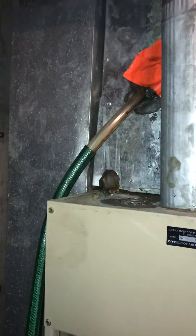On the panel, we had a 30 amp circuit breaker, so we'll put a 20 amp fuse disconnect on the outside with a new whip.